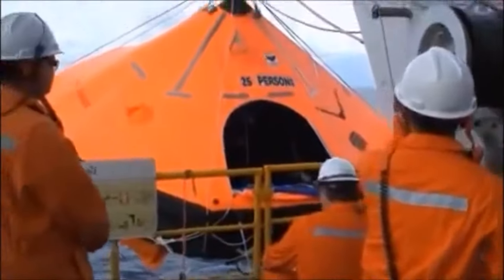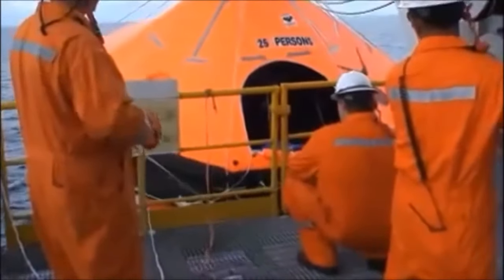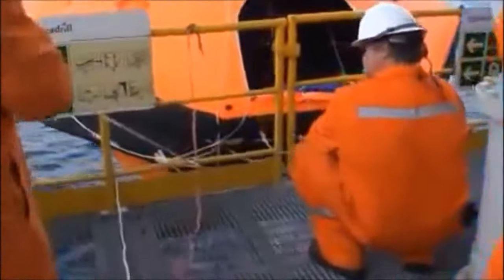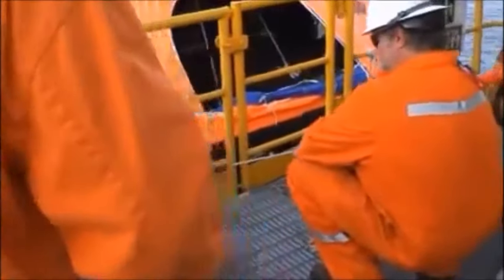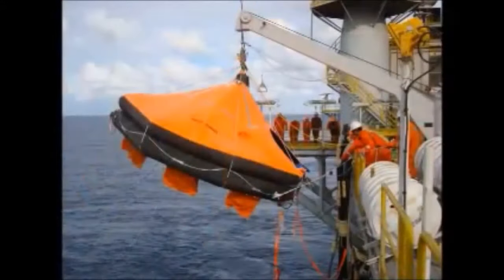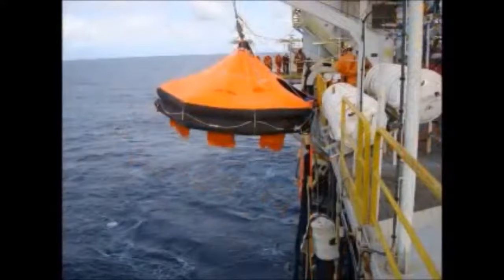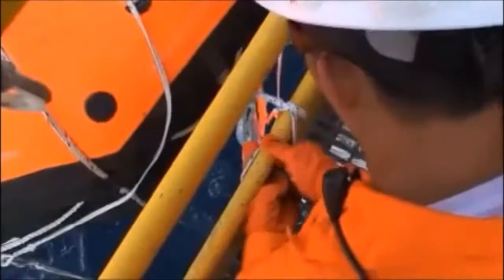You may have to push the brake and lower the rope to even up the raft with the deck. Tension the hoisting lines to ensure that the life raft is flush against the red sides. Tie off the hoisting lines.